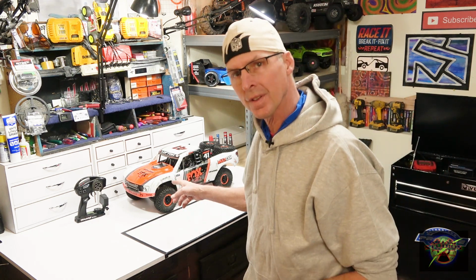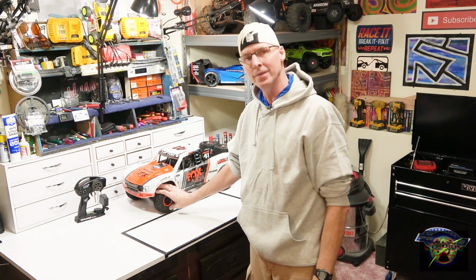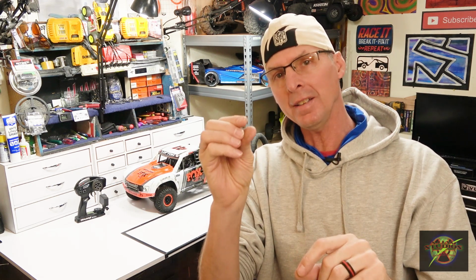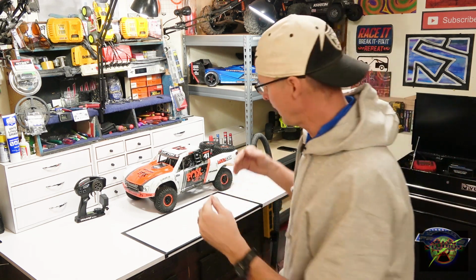And not only that, but we had a problem with the hubs. The discs for the hubs, you know, these are initially made out of plastic and they're not all that durable. You think about it, you're driving the size of a tire and you're driving it on a tiny little area where there's a pin in a piece of plastic, and it doesn't take much to hog that piece of plastic out and make it useless. So we did the upgrade and we turned those to aluminum.